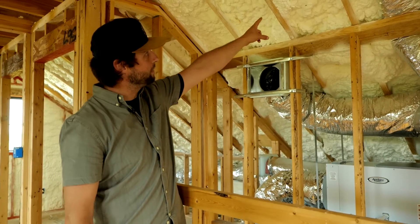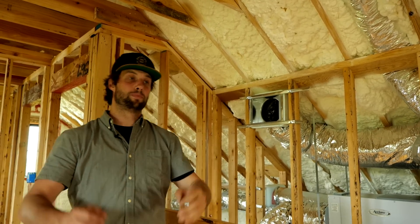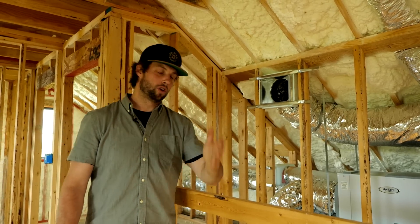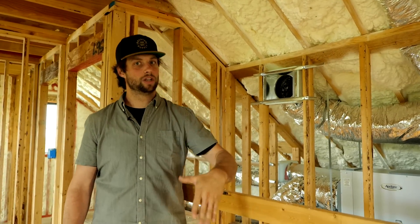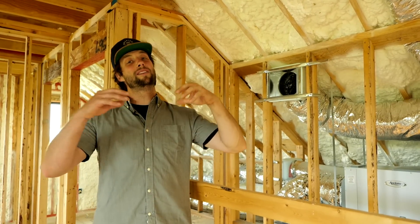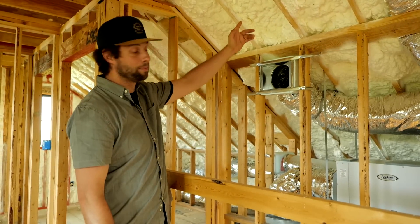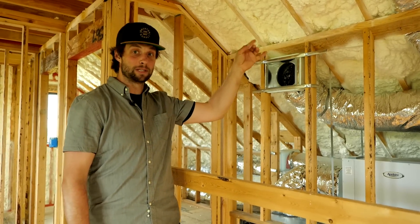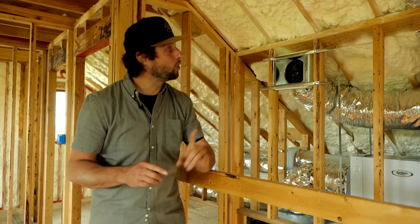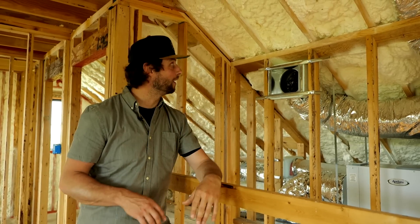Second point of contention: if you look up here, you can see that my roof deck on this Belleville farmhouse is spray foamed. Now remember, we have Tech Shield up there, and I said if you're using a radiant barrier like Tech Shield, you cannot let your insulation come into contact with your radiant barrier because it totally defeats the point. I've totally defeated the point of having radiant barrier up there by putting spray foam completely up against it — it's doing zero good. If you'd like to know why I did that, comment below and I'll do a video on it.